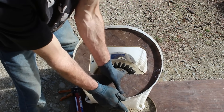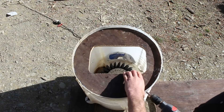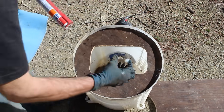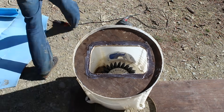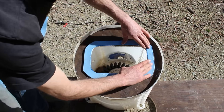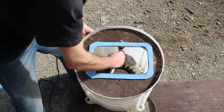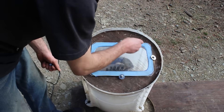Silicon sealant around the edges keeps it all watertight. It should be a nice tight fit — push it in around one inch from the edge and screw it in place. Cut out a piece of foam for the seal around the service hatch and glue it in place with some silicon sealant. Before the silicon sets, drill four holes around the edge of the perspex and clamp it down with four stainless steel bolts, using wide washers to overlap the edge of the perspex.